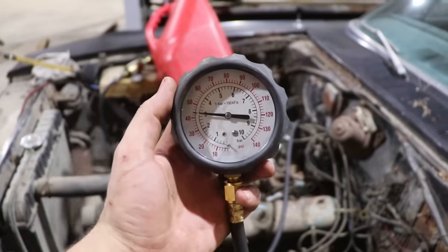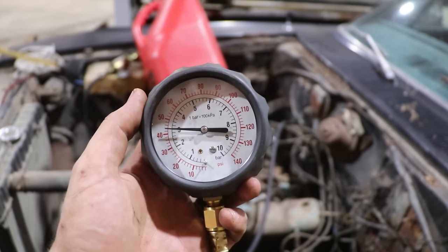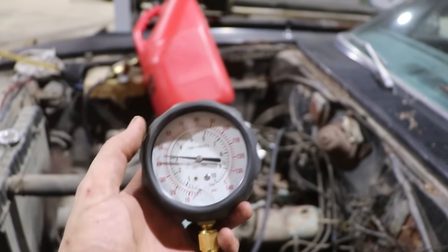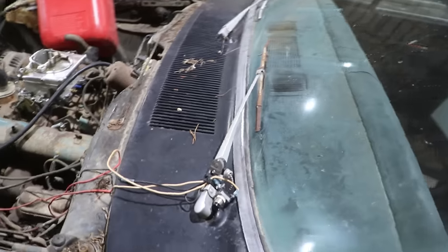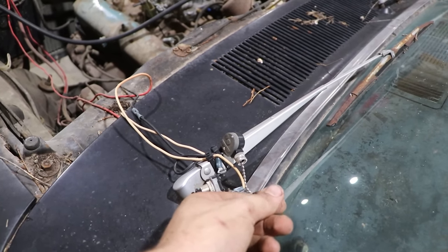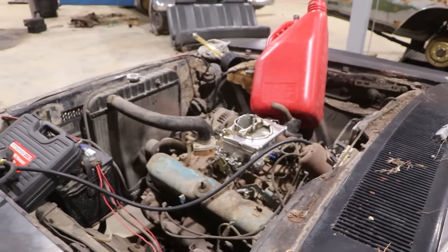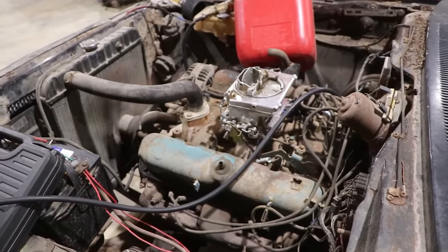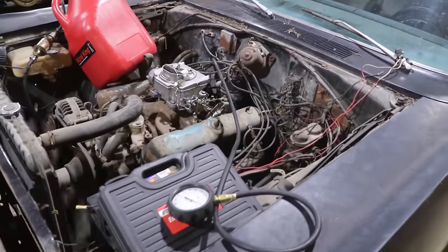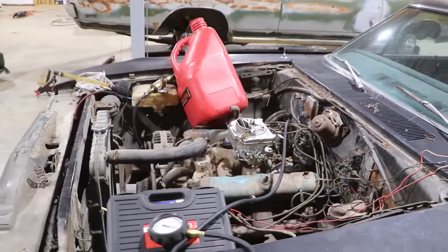After all that movement, we're looking at a little over 40 PSI, so I guess a 20-50 if that's what it's got in is probably a good idea, but we'll change it regardless. Hot idle, 45 PSI - that's fantastic. Very excited about that. This is the ignition by the way - this is how they rigged it up. It looks like it's from a ceiling fan. There's a push button - you turn that back on, push the button, and it starts right back up. Got a little life left in her. She's out of fuel so it'll be easier to take this thing out.